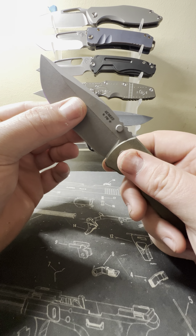It is very well made. These are made in a shop in Alabama and pretty much everything is done in-house, which is why the hardware is stainless steel. He does have titanium hardware available — made by Tie Connector, which is cool. One thing to note when disassembling: the screws come out from this side but the pivot is pressed in on this side, so you unscrew the pivot from the lock bar side, then unscrew from the other side. It's a little weird but it came apart fine and went back together well.